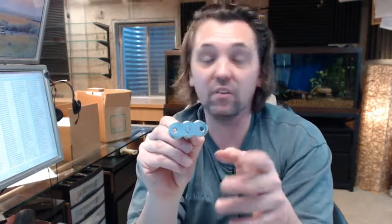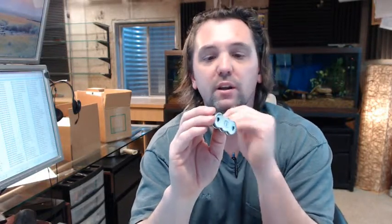Mortise 1 inch diameter, top of door and header, 5/32 deep as shown. You can see that you've got 5/8 of an inch center line from that 1 inch this way and that 1 inch this way. When I've done this, being lazy, wanting to do it the easiest and cleanest way possible, a Forstner bit is how I've always done it. I would take a 1 inch Forstner bit, mark my 3 center holes, and just zip it in. Clean hole, no mortising to do. Do that to the top of the door and to the header.